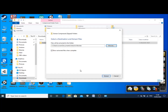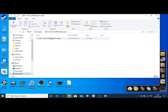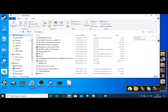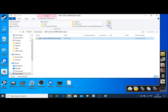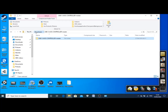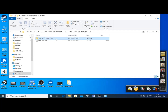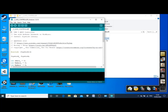Then we need to load the sketch onto the Pro Micro. Find the downloaded 5-axis controller file, which is included in the description — this is courtesy of M-Studio. Extract it anywhere, then keep clicking through the extracted folder until you find the sketch which will have the little Arduino logo beside it. Double-click it and it will open the Arduino IDE. If you're familiar with Arduino you'll probably recognise the code; if not, don't worry — you don't need to do anything with it.